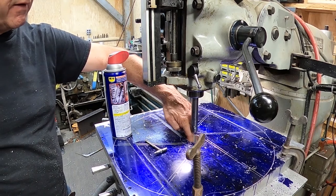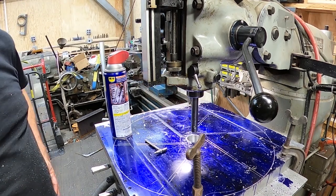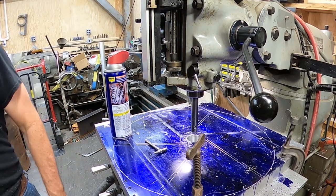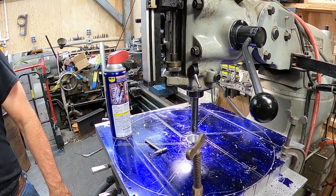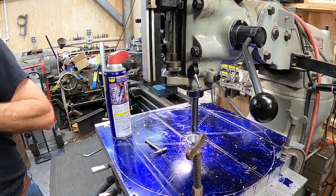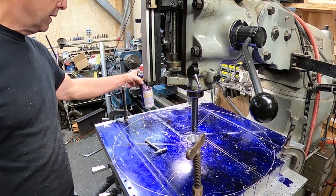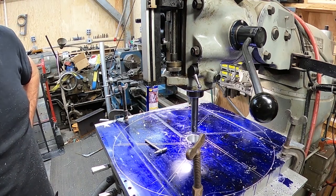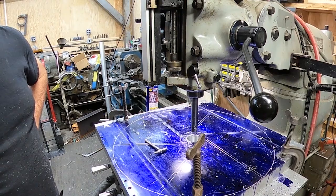That'll allow that dirty shaft to fit in there because there's not any real strong highs or lows. So I think we're going to be good. I think that this is going to be just perfect. We're about 25, is 2/1000 over, really, is all we are. A little bit over 2/1000 over. So I think that is a perfect fit myself onto a shaft. That'll make a nice slip fit, and that's what we want. So we achieved our goal.